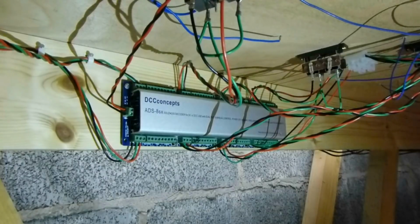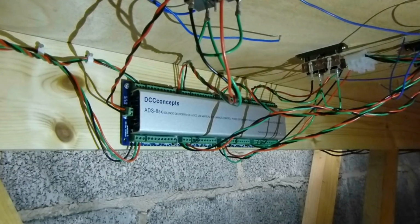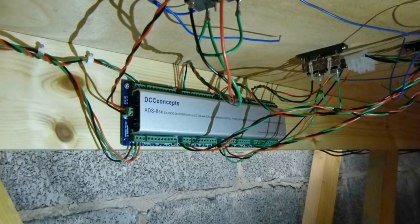First up, I've been putting in solenoid point motors to all of the turnouts at the storage yard, and that numbered 21 new point motors. I didn't fancy feeding all the wires from each individual point motor back to the central control panel at the station. That's a heck of a lot of wiring, and I also fancied the idea of controlling them through DCC with a mimic control panel with LEDs.